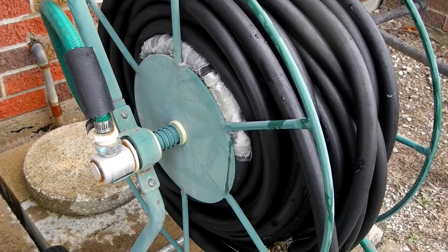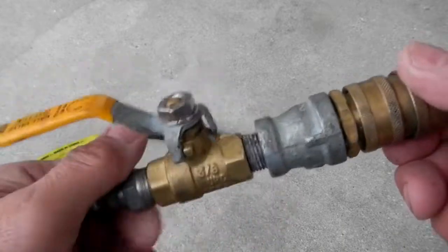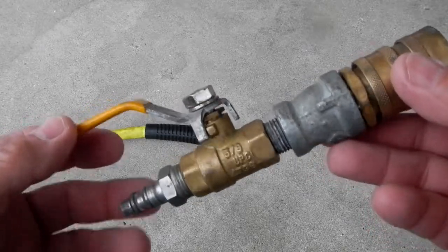The next issue is what do you do with the water hose. I keep my hose out all year long, and obviously the water is going to freeze if you don't get it cleared from the hose. So I came up with a contraption using air pressure to fully evacuate the hose to make sure all the water is out when you're done — because I leave mine outside year-round.